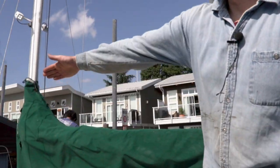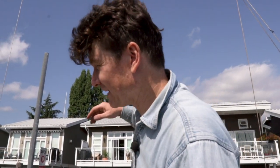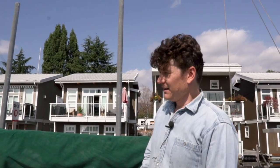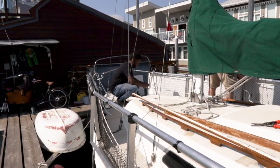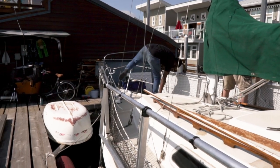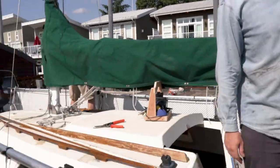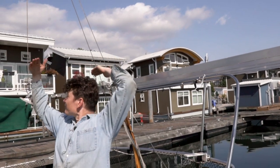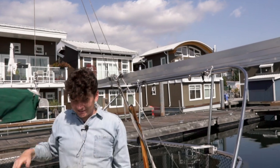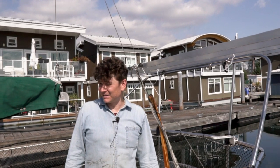The panels on the sides are a bit ungainly. My intention was to go all the way to the front with five panels giving 500 watts per side, but I was concerned about visibility obstruction. When sailing we'll generally have the side panels down so they don't interfere with the rigging, but you lose line of sight to the water. Longer term, if this is more solar than we need, I'll probably remove the front ones and keep just two panels per side, then extend the rear array forward just in front of the boom — that would also increase shade and rain coverage while transferring a couple hundred watts without much solar loss.